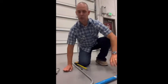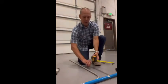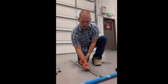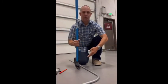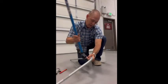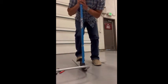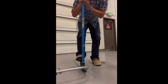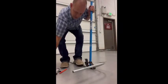I measure five inches on this pipe. From this back 90, I measure out ten inches, because I'm going to do a five-inch lift — five times two equals ten. I put it there, and now with my kick I put it on my arrow and I lift this up at a 30-degree bend. I know my multiplier is two, which puts me right at five inches. When my handle is straight up and down, that's my 30-degree bend. You can see there — I measure and I'm at five inches.